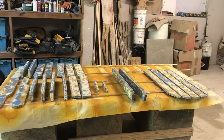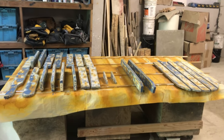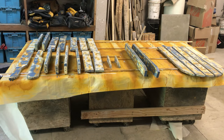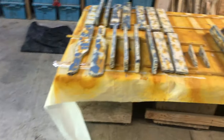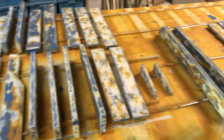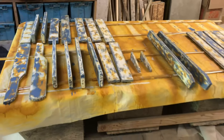Got all the pieces painted — started with the white, went to the yellow, and then the blue — and I sanded in between all colors. Now this is all sanded and ready to be sealed using a 100% acrylic sealer carried in a xylene-based solvent. She's pretty good looking. Got everything sanded and blown off, just about to wash it, let it dry, and then I'm going to spray the sealer on it and start assembling the chair.